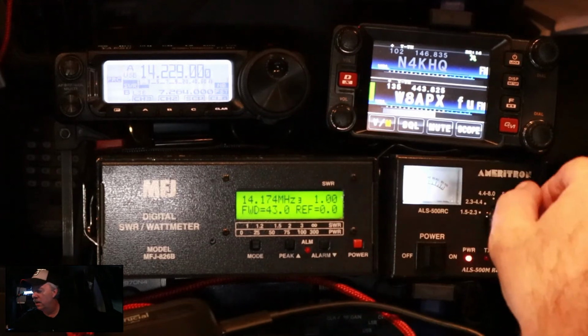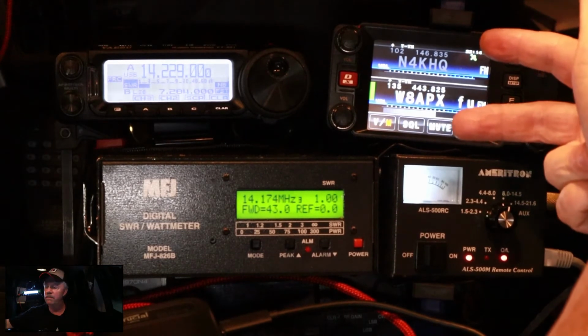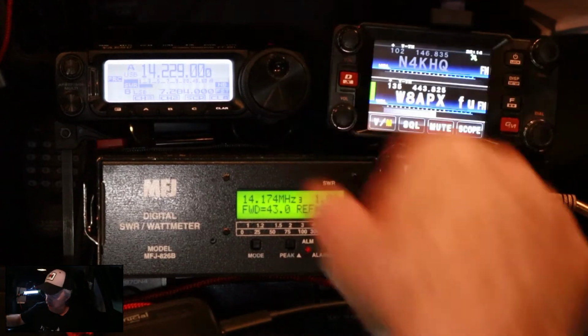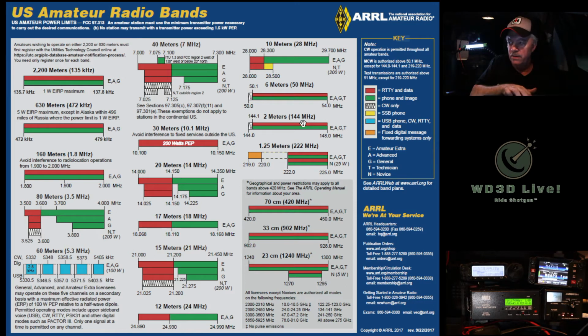We are cleared. So that's just an idea. You've got 2 separate repeater systems, 2 channels on this radio all by itself. And again, what we just did was 2 meters for the top row and 70 centimeters for the bottom row on that radio. Once you leave VHF and UHF, you come into HF, and that starts around this area right here, 6 meters to 2,200 meters.